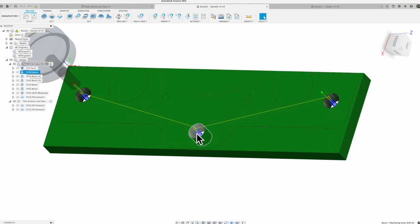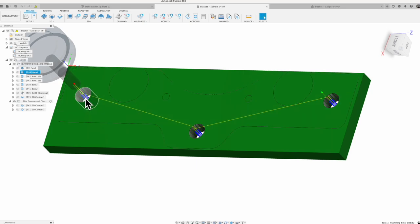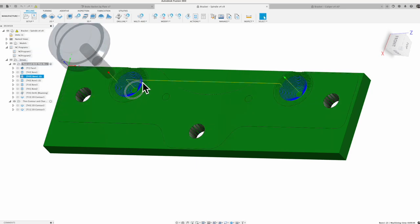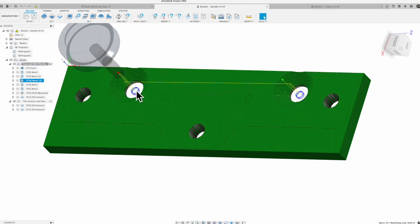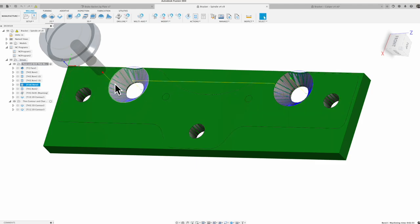Go through and bore these holes. I don't have a drill that's over 1/2 inch. So just going to go through and bore those really quick. Use that same tool bit to rough bore these countersinks in just a standard boring pattern. It goes through and it step bores those out. And then we'll finish bore all the way through for the hole that goes through those. Then we're going to change out to that 82 degree countersink bit and we will finish boring on those countersink holes.